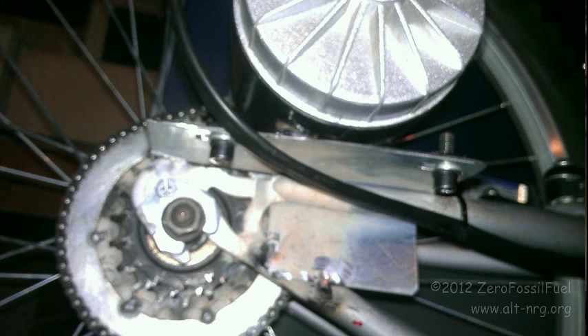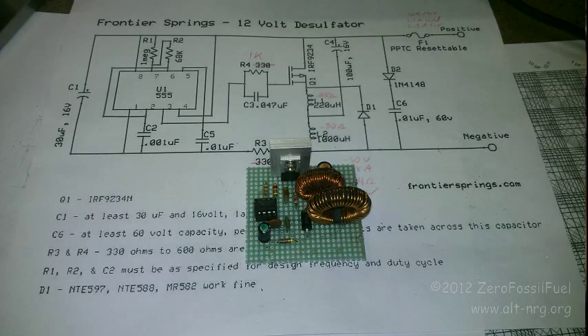To power this thing, I had planned to use lead-acid batteries — the standard 12 volt, 7.2 ampere-hour batteries. I had a bunch of them laying around, and a lot of them weren't very good. So instead of going out and buying some, I ended up trying to use some of the spare parts I have around the lab, and I put together this schematic diagram of a sealed lead-acid plate desulfator.